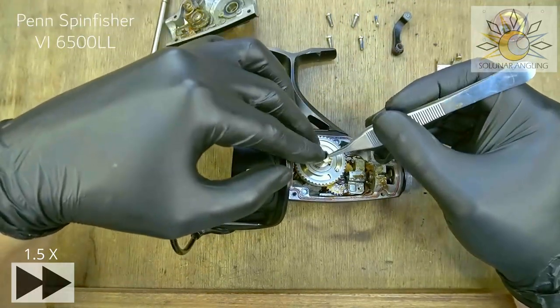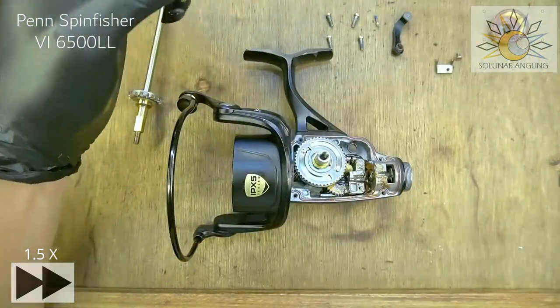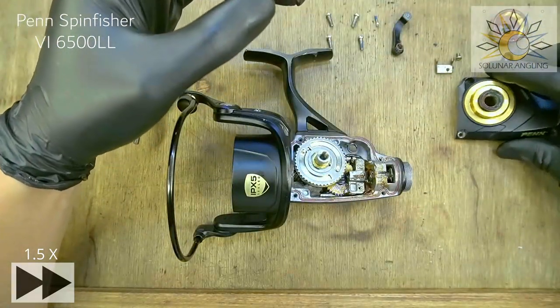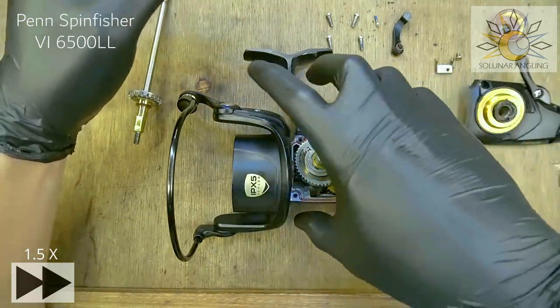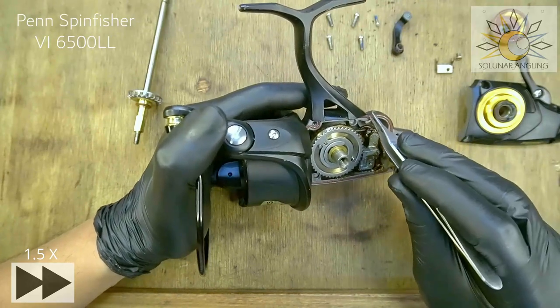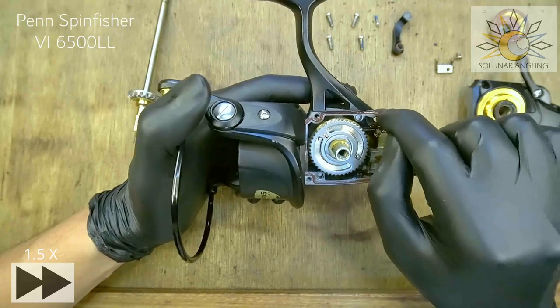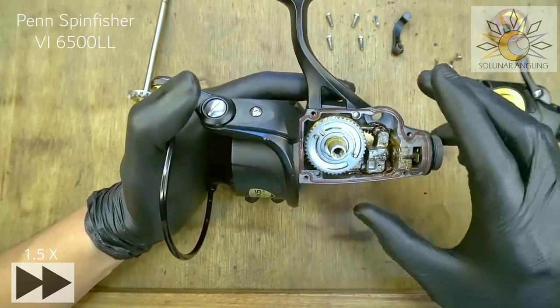So these are the two washers, just going to put them back here. So we're going to do this afterwards, because now what we need to do is to disassemble the rotor first. So this one here is a seal. If you want to remove it now, it's fine. But I'm just going to leave it there because the seal is quite tightly fit into its groove.